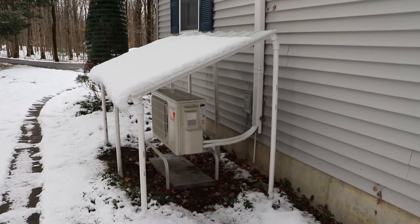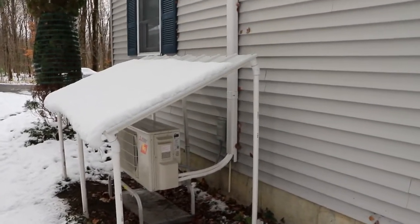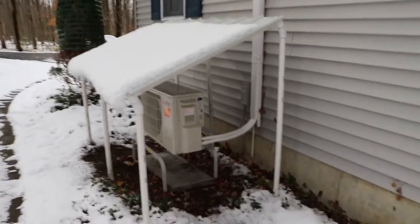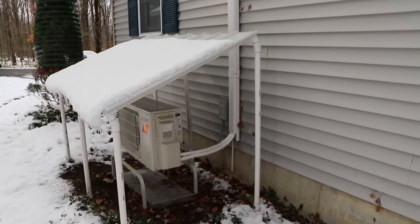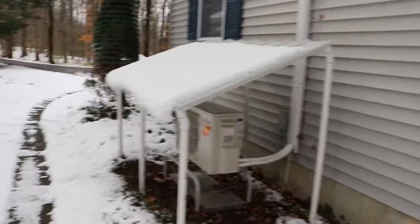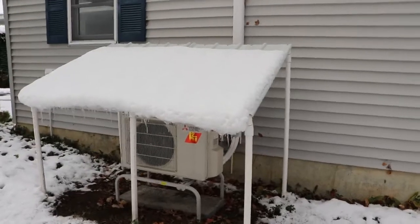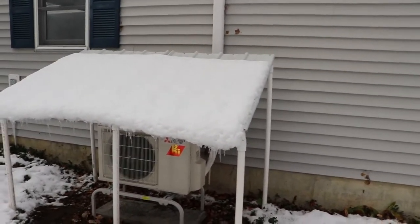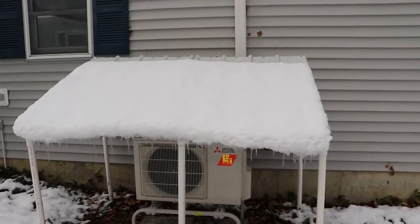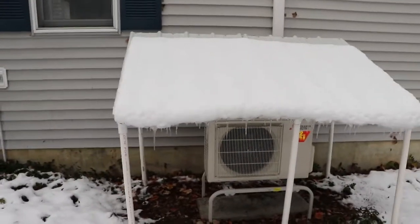Hey, what's this? It's called snow. We get a lot of snow up here in upstate New York — maybe a hundred inches per year. Sometimes we get big blasts coming off of Lake Ontario, might get two feet of snow in a big storm. So we don't want that piling up on our heat pump. This is an extreme cold-weather heat pump, going down to 13 below Fahrenheit, and we don't want to have to come out here in the middle of a freezing rainstorm or snowstorm and try to clear it off. So we have this little hut built around it, and it's fairly easy to make.